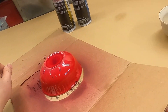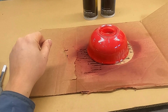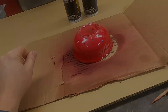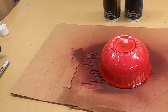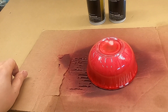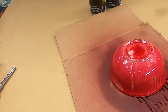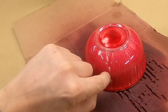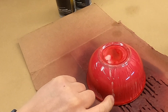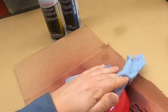We'll let that sit for five minutes per the instructions and then take a look. It's been about five minutes — I think it's been long enough because it looks like the crack is over here and it was holding on to some of the cleaner, so it pushed away the penetrant. Let's clean this up and see what it looks like.